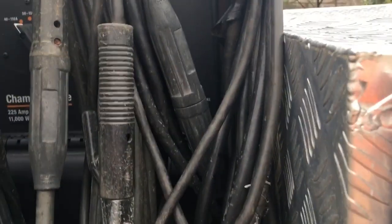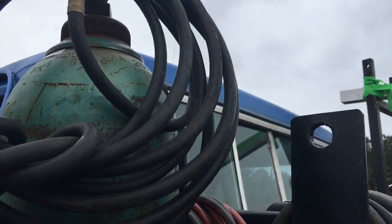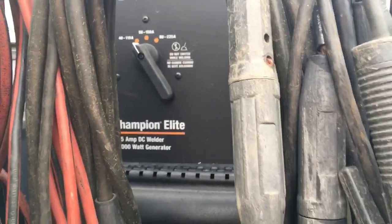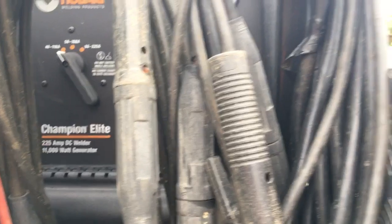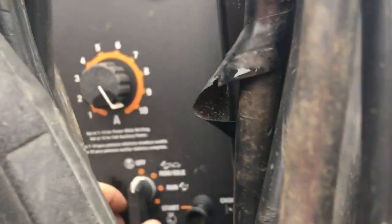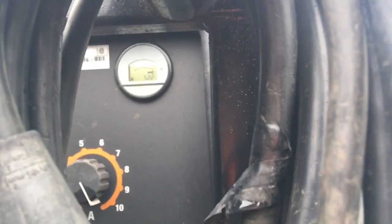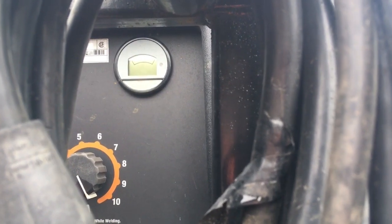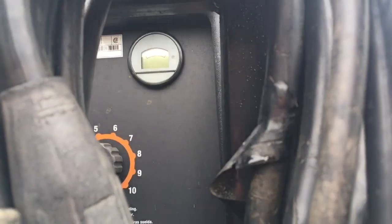The Champion Elite is the bomb — absolutely fantastic. You can see my lead racks I made a while ago: stinger, ground, extension cord. I don't run with all that all the time, just around the shop. I did a video where she got her first oil change. About another 50 hours or so and it'll get another one — oil change every 100 hours, and I always change the filter. What's really cool is this display tells us how many hours are on the machine, and the next click tells us how many hours until we need to do maintenance. As I showed in my oil change video, you just click it three or four times and it resets to another 100 hours for your next oil change.